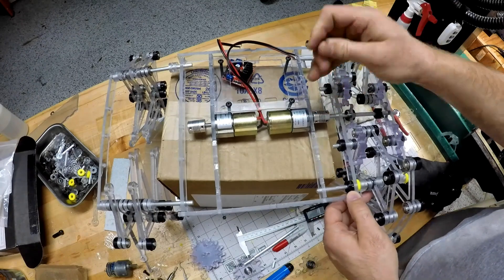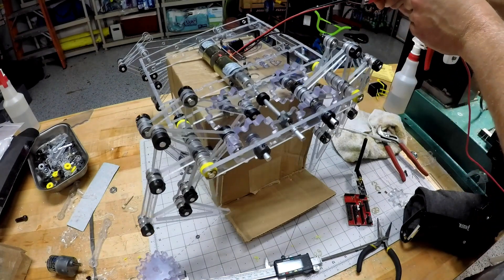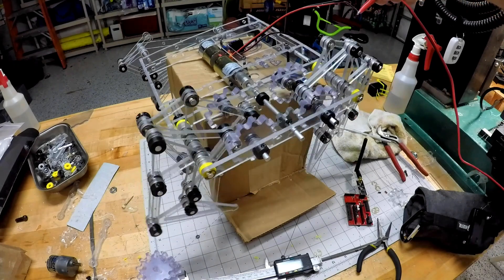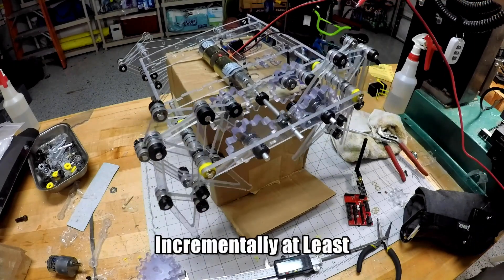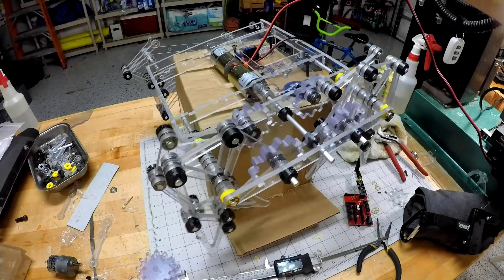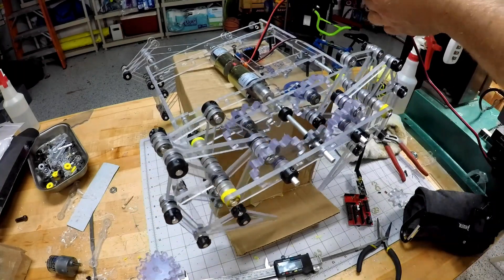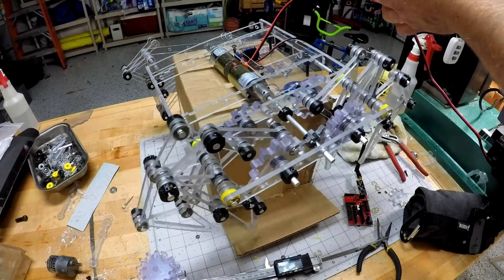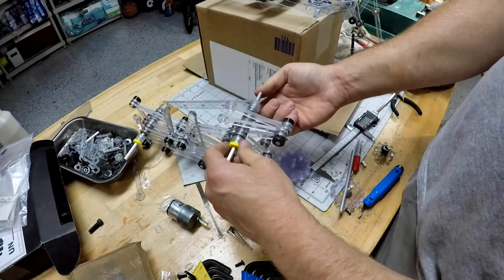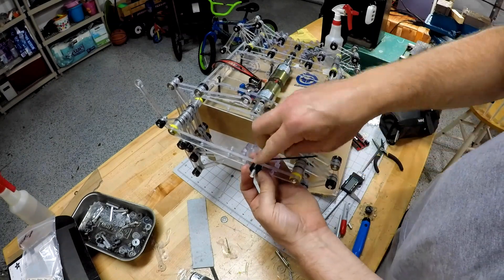The gears look nice, and of course you can't forget to tighten down the misalignment coupling. Got to attach it to the motor too, but looking pretty good - it's time to put power on from my power supply. Here we go, and that's a small success. The cool thing about the power supply is you can adjust the voltage as you wish, so you can make it go a lot faster or slower, very linearly. The controller I use in theory has PWM functionality, but right now I just hooked it up for on/off control, and you'll see more about the electronics in the second video.